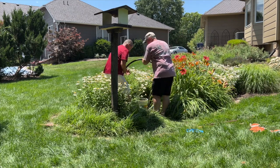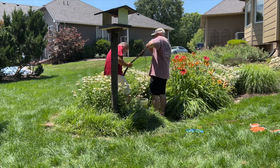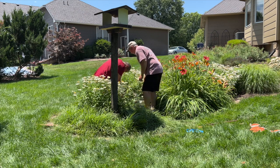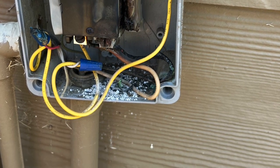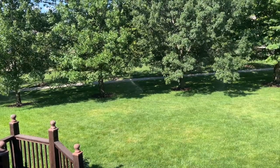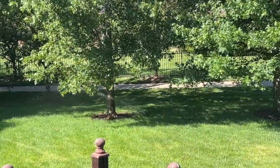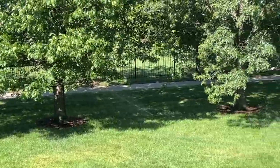It should take you about an hour if you have everything on site. We ran into a few difficulties — we had to rewire from the house to the pump because they originally installed wiring that wasn't really water resistant, so we redid that. We also found our pump relay was burnt, so we replaced it, which isn't too hard — just four screws and making sure you know where the wiring goes. You want to shut the power off. And as you can see, we've got the sprinklers going, everything's back working fine and we're off and running. Thanks for watching.